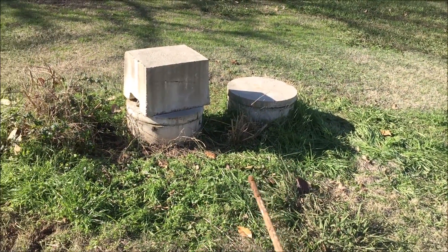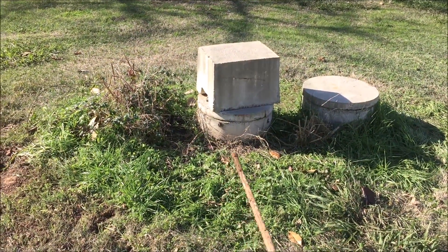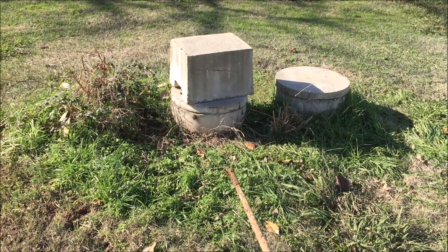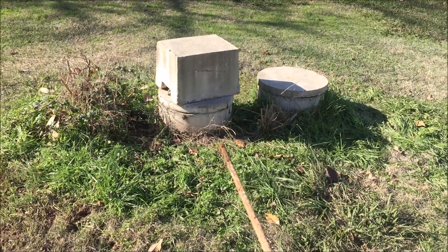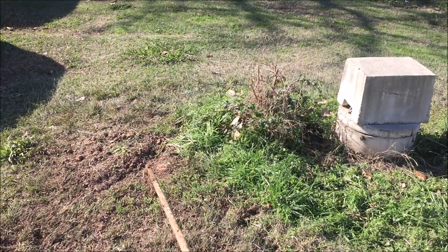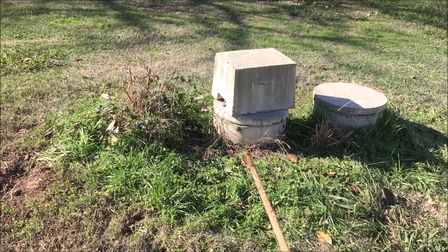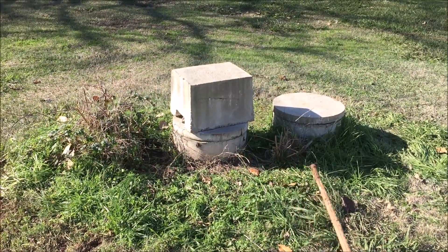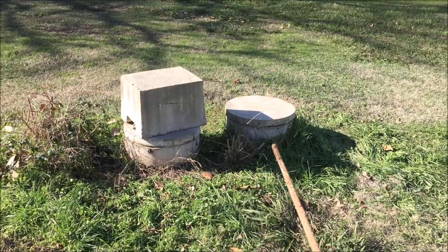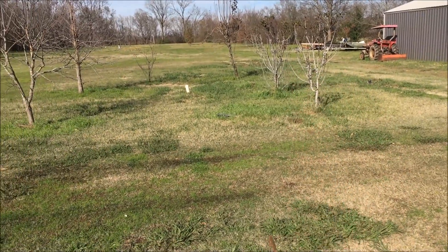The aerator is alarming right now because it's not feeling any resistance — there's not enough water in there yet. That alarm should go off once the water fills this tank to a certain level and pours into this tank, then comes up to a certain level. Once it pours into this effluent tank and the float switch is activated, the pump will cut on and push the water out to the three sprinkler heads, and all should be well.